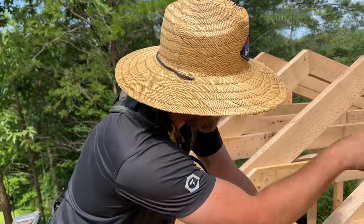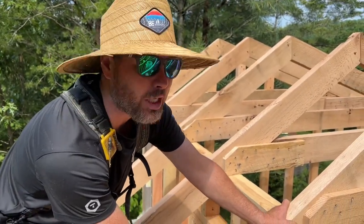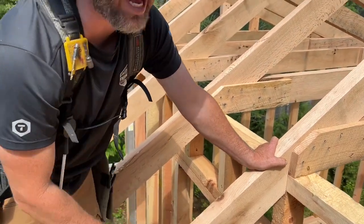We're putting this roof decking on, and I want to point out how much difference wall and roof sheathing makes on our normal builds. We have this thing braced up pretty well with diagonal bracing, and still — Ray, can you see that? I'm shaking. We can still wiggle this thing all around. Continuous diagonal bracing is exactly what your wall sheathing and roof sheathing does, which is what makes a modern wood frame house really strong.